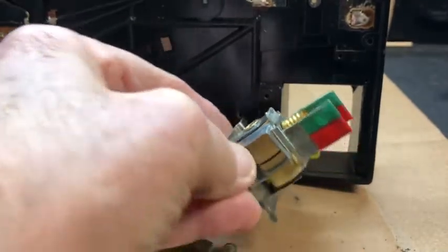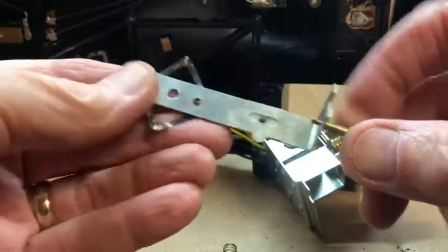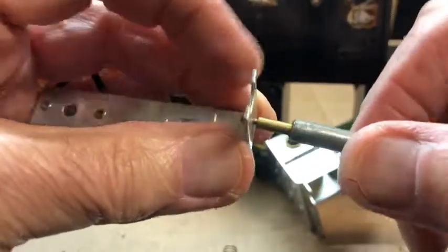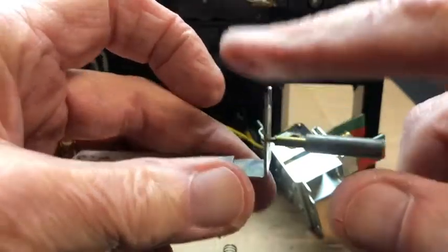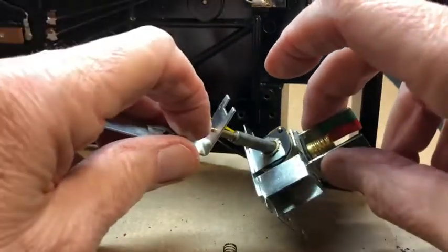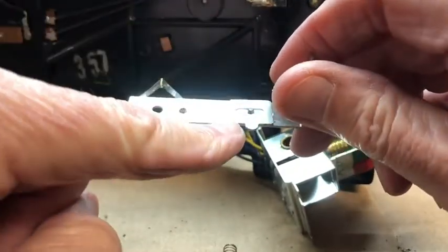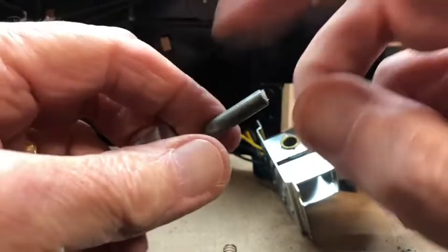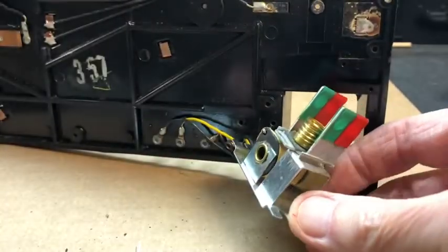And there is the solenoid. Here is the plunger and the arm. I'll clean the top contacts — you can see how black they are. Using my usual process I'm going to thoroughly polish this plunger used in the solenoid. The plunger is not attached rigidly to the arm, which allows you to pull this lever out by sliding it underneath that slot. It's fairly easy to reinsert and reconnect — it just takes a little finagling. I'm not going to disassemble it further since it looks factory-centered. I'll wash it and thoroughly clean the interior of the solenoid. I've found that cleaning solenoids rather than lubricating is what gives better performance.